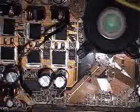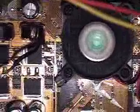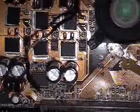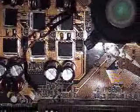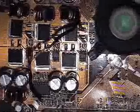Here's another look at the connections that were made. The bottom connection is to EC153, and the top connection is just to the left of the heat sink and fan on the motherboard. Something you should probably do for safety is cover the resistor with electrical tape or heat shrink. It's a very quick job if you take your time, but make sure you are very steady and cautious. If you are timid about doing this, I would stay away, because it is quite a tricky operation.